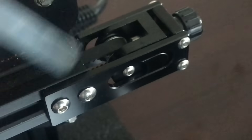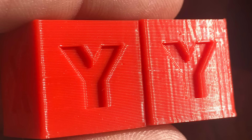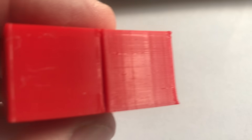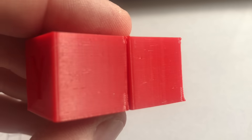So I tightened it again and this time used a finger-tight approach like some people have told me — tight like a tension. I still got a wave. It was better but you can see a wave on the Y and a slight wave across the X. On the smooth side you can really see it — the wave on the looser belt versus the first print I did.